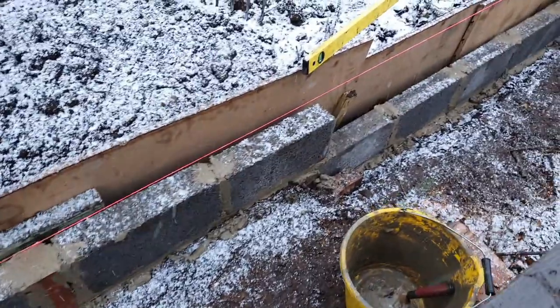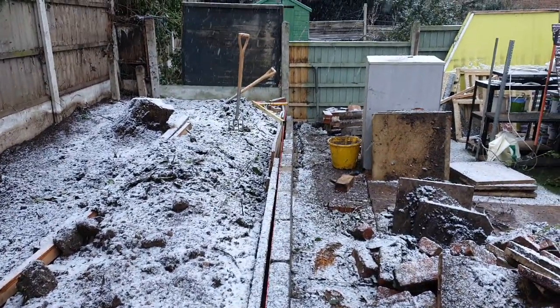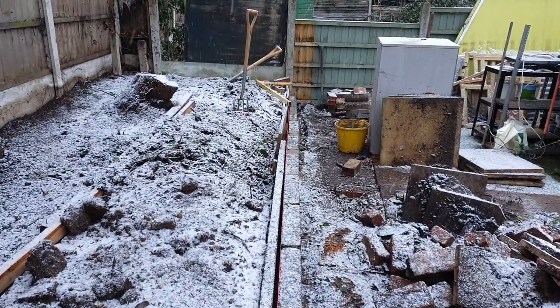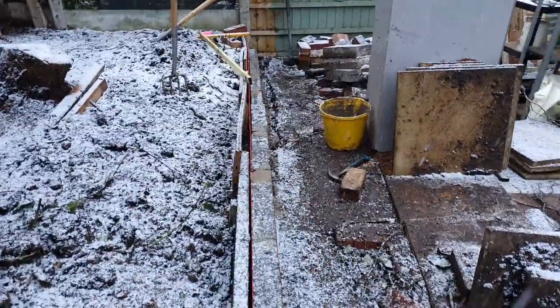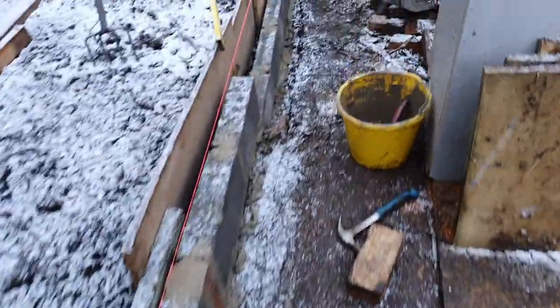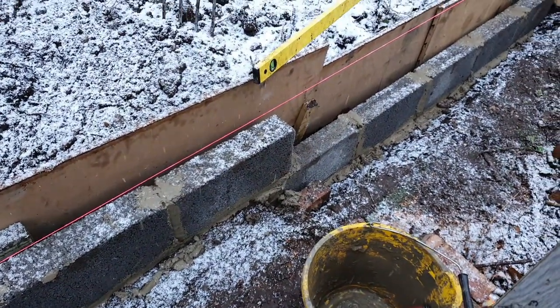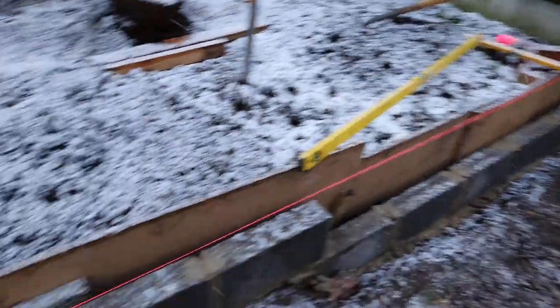I broke up a load of the rubble — as you can see there's a lot less there than there was. We've put that into a trench about a spade-width and a spade-deep, thereabouts. There's just a little bit of a dogleg in the middle of the screen simply to get around the shutter, but that's the course that's going to be buried so I just nipped it out and around there — you can hardly tell. On the second course, which brings you up to the same level, we'll straighten it up from there.